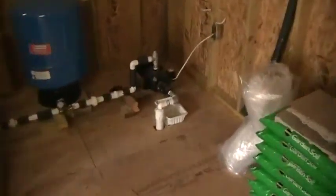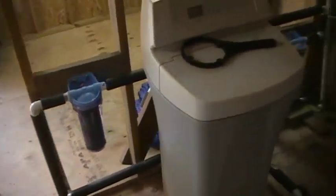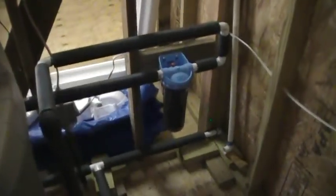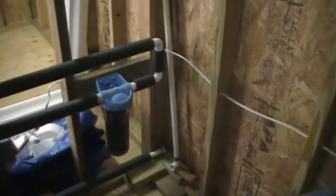But like I said, I still have my bucket here for where I have one small leak that I'm going to try and get to. I also installed insulation on all the pipes going through for our cold weather. I'm going to be putting on the elbows next. This is all 1/2 inch foam that you put on, and then you get the 1 inch foam, and then you just cut it down and it fits over all of these, just like this one corner here, if you can see it. I've got, like I said, my future line I've got to bring in for the hose bib. It's all glued and everything ready to go. I just have to connect it in, tie it in when it's ready, then I'll be ready.